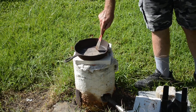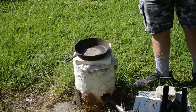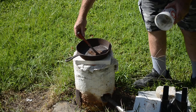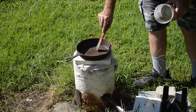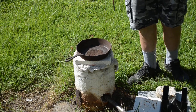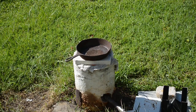The color of this stuff is darkening up as it roasts — those golden sulfides are turning into darker oxides, so it's working. While the frying pan is good and hot, I'm going to go ahead and roast up the rest of the sample feed too. This stuff has a whole lot of sulfides in it. They've been oxidizing away on their own in the week or so since I panned them out and darkened up a lot, but it's amazing how quickly it's darkening further — turning very dark brown — so there were still some sulfides that needed to be oxidized.